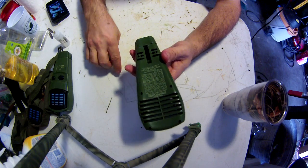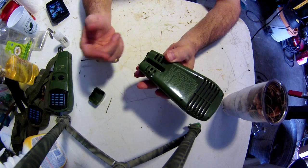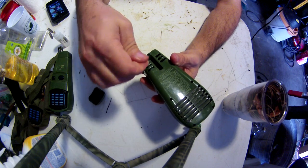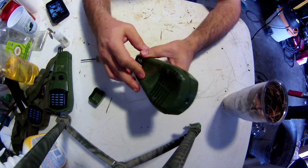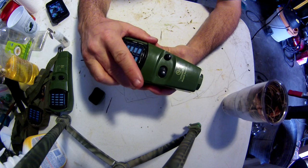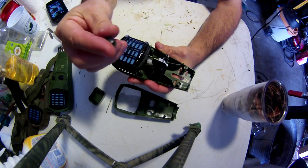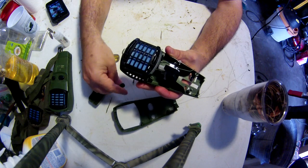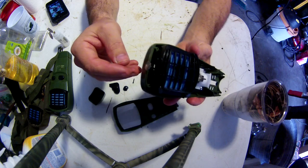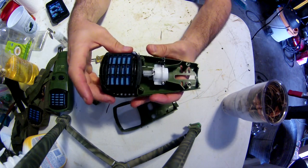You'll loosen them up — I've already done that. You want to take your end cap off. You've got a butane cartridge in, go ahead and take it out. Sometimes the little screws from back here fall out. Go ahead and disassemble it, take the cover off. You can take your ignition button off, your on/off switch. Up in the front your clear lens actually comes off and it'll fall out a lot of times, so you don't want to lose that.